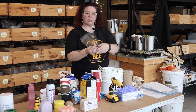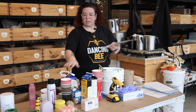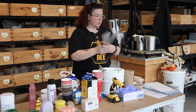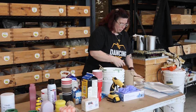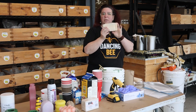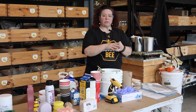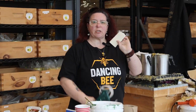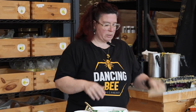There are also different ways to make some containers for your molds. If these ones don't work or you have a really weird shape, you can use acrylic sheets. You can also use wood if you need to. I do recommend that if you use wood, you may want to coat the wood in some tape just to make it smooth, because the wood tends to be a little porous. So we're going to go through all that and we'll be right back and start making some molds.